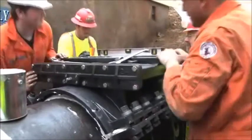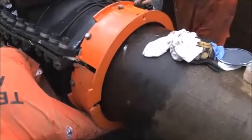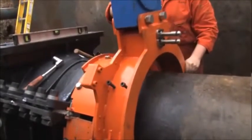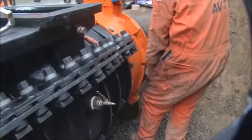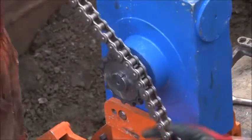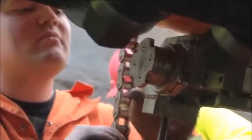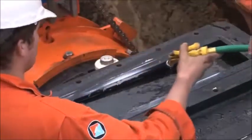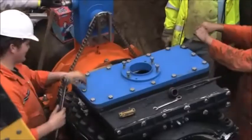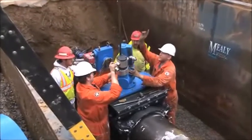The EZ valve is leveled. The drive ring is attached to both the pipe and the valve casting. The rotating gear drive is attached to the drive ring and tightened. The valve rotation chain is attached to the valve and around the gear drive mechanism. Water is added for initial cooling and lubrication of the milling process. The slotting adapter plate is attached to the EZ valve built-in isolation valve and tightened. The end mill machine is then attached to the adapter plate.